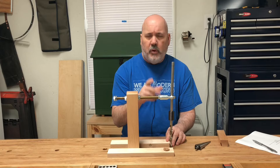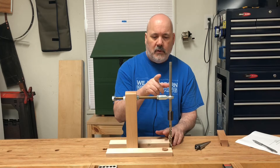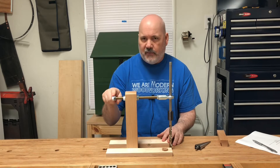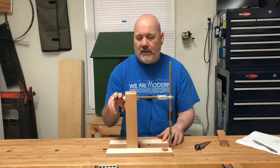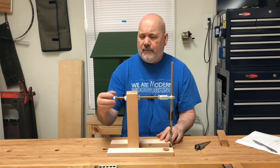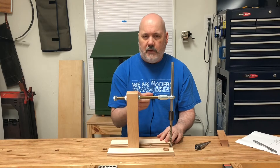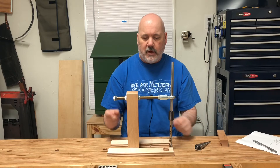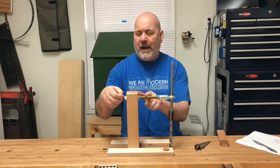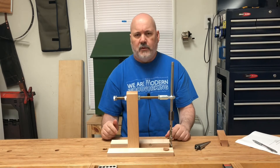Some other functionality — and I've had this in the hands of a number of people to test — is you can move this bearing from the long side to the short side and utilize it over there if needed. No one's really had a use case for that, but it is possible. You'll also notice I've got two jam nuts locked together. That's so you can put a socket with a drill on it and move the rod in and out if you need to adjust it past the ends of the runners or shorten it up. This is threaded at half inch by 20 threads, which is great for fine tuning but not for gross adjustments — the jam nuts give you the ability to do those gross adjustments quickly.